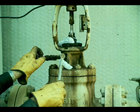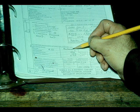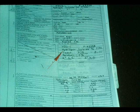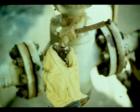The solution to the problem is also obvious: lubricate or tighten the packing. But before you adjust the packing, obtain the operator's permission to enter the area and work on his equipment. Consult the specification sheet and find out what process material is in the valve. You would wear an air pack if the packing on this valve was leaking excessively — H2S is lethal. Always wear eye protection and gloves when adjusting or lubricating a control valve.